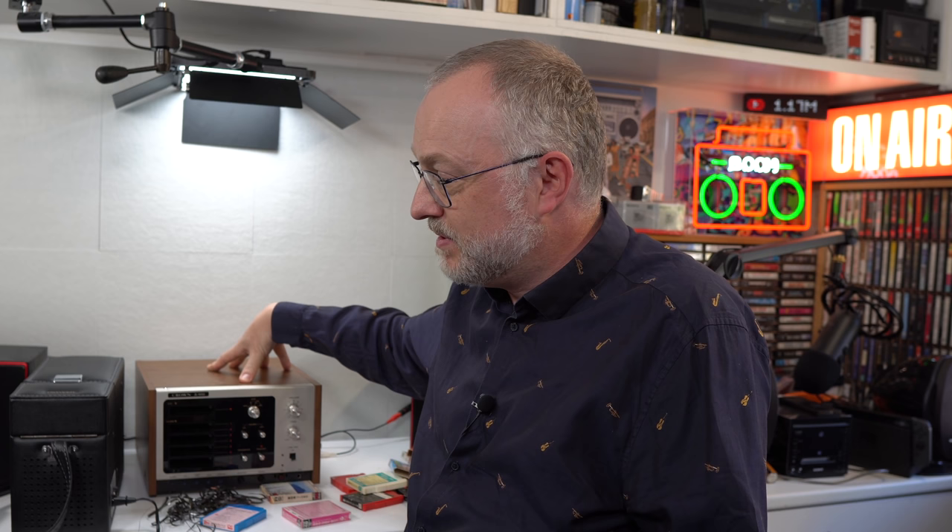So what I suspect is going on - and I'm pretty sure about it now - is this has been designed to run special cartridges that just happened to be the same size and shape as the HiPak, because why not? They already exist. I've played NAB carts before at various different speeds - there's a background music cart that runs a lot slower than one you'd use as a radio DJ. So it's a similar idea: using the same cartridge style in a different machine, playing it back in mono at a slower speed. So if you fill this thing up with music, it takes a lot longer to get through all that music before it loops back to the beginning.